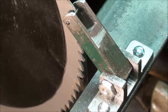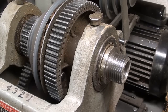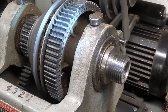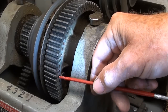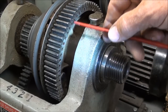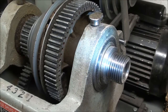Here's a little sidebar - I'm over at the Craftsman Atlas 12-inch lathe. Many years ago they took the trouble to make this gear here as an indexing device. Some of you know you have that in your Atlases; others maybe didn't know what it was, or maybe not all models have it. Look at the holes here - I'm not going to count them now but it seems to me there are 60 holes. Let's just say for the sake of conversation there are 60 holes, so you could use that as a dividing method for other projects.